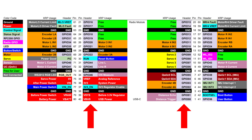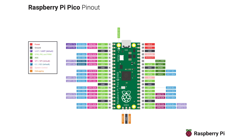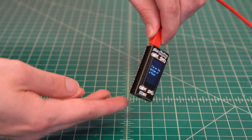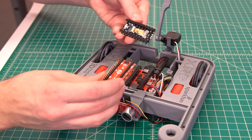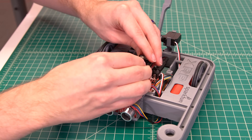The inner two rows are almost identical to the Raspberry Pi Pico footprint and pinout. The only difference is that different GPIO pins are used for the ADC pins, since the RP2350B uses different GPIO pins for the ADC. This identical footprint means you can easily plug in existing add-on boards designed for the Raspberry Pi ecosystem, such as this display board from Pimoroni. Be aware that many of these add-on boards are designed to go on the bottom of a Pico with male headers, whereas the XRP has female headers on top. To ensure those add-on boards can be used with the XRP, we created the Pico Add-on Flipper, which flips the header rows and genders.